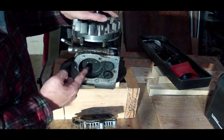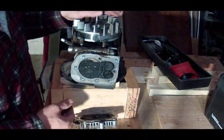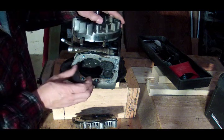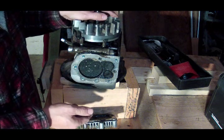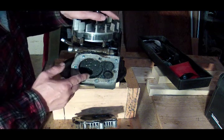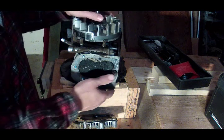When the piston gets down to the bottom, the exhaust valve opens back up, and as the piston rises back up it pushes that burned fuel out of the exhaust valve, out through the muffler, and then the system starts all over again. So: stroke one — intake valve opens, suck the gas in; stroke two — piston rises up, compresses the gasoline; stroke three — spark plug ignites, bang, pushes the piston back down; stroke four — exhaust valve opens, piston comes back up, pushes the exhaust out. Both valves close and the system starts all over again. That's why it's called the four-stroke engine.